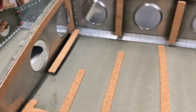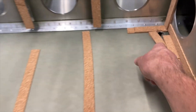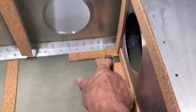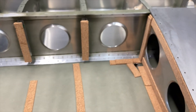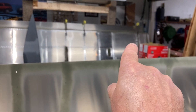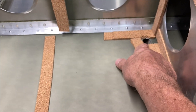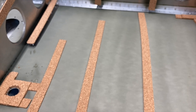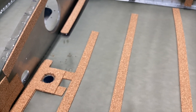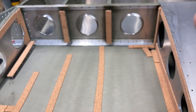When this one sat in there it really needed to go forward, so we had to take quite a bit out of this hole — same as what happened to the other wing. I elongated and sanded this one. A word to the wise: when you're fitting and it all looks good, look underneath with a mirror and see how the holes are sitting, because you're going to have to modify them if they're touching, and you'll have a real tough time once it's all riveted up.